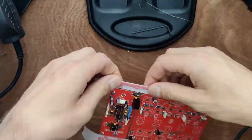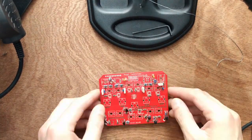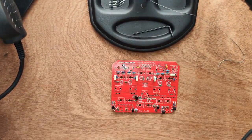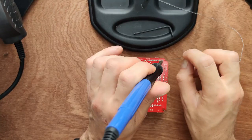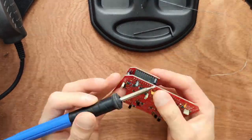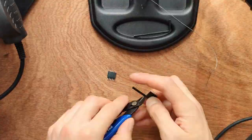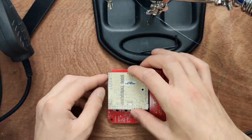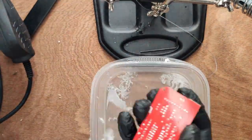This is a good time to remove the side rails — use tape and a vacuum cleaner to avoid any glass splinters. Continue with the control board: place the screw and spacer, then cut male and female pin headers and join them together. Place the two 10-pin headers and mount the smaller PCB. Solder one corner pin on both headers on both sides, make sure the board is mounted flush, then solder all remaining pins. Cut and join all remaining pin headers, place them as indicated in the close-up, then mount the OWL board. Solder one corner pin at a time, and when flush solder all remaining pins. Clean any residual flux.